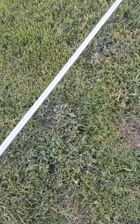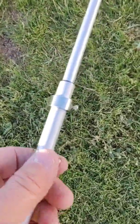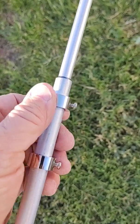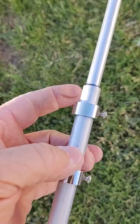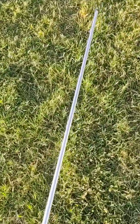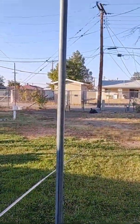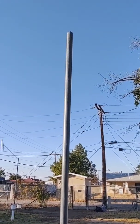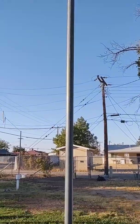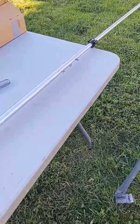Up here are two wing nuts and bolts, and then right up here are these two clamps. Be careful with these — if you back those little bolts out too far they'll fall out and you can lose them. They go through a hole in the mast and clamp against the top section. There's a rubber protector at the top. This antenna is now ready to go. All you have to do is put it on a mast — we've got a tripod with a mast set up here for illustration. Just lean it over, slap it to the mast, put your coax on it, crank it up, guy it off, and you're on the air.